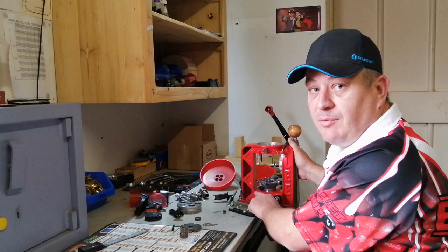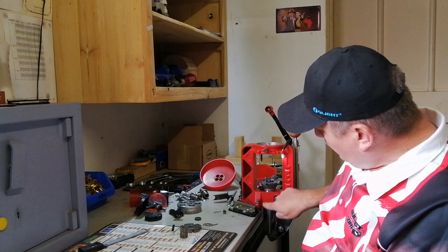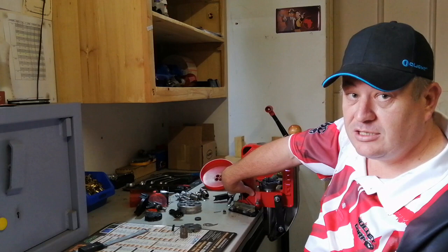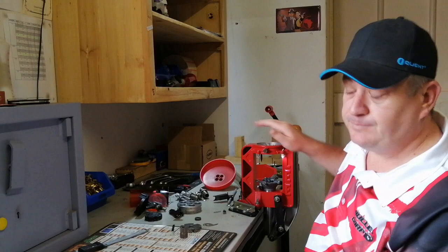You will need six bolts plus a couple of washers to secure the press properly. This press is big and heavy, and there's a lot of reaction happening off the desk — all your leverage is here, not secured on the desk. It's only this base ring that secures the press on the desk, so you need to have it mounted properly, sturdy and secure.